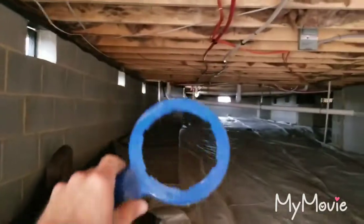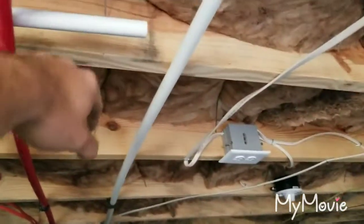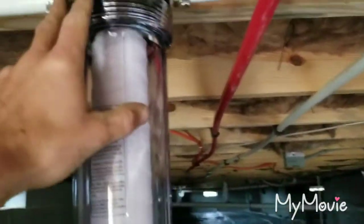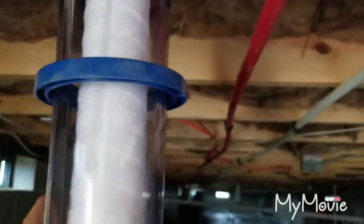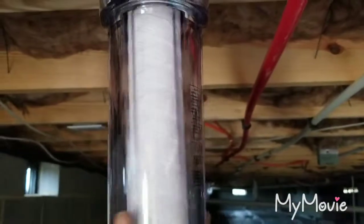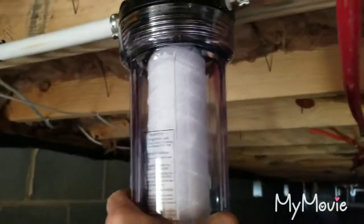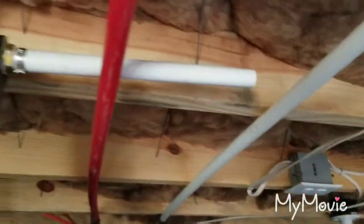If you get a filter, you'll notice it comes with a blue wrench. In order to change the filter, you have to turn this valve off and turn this valve off. There's a little red button up here — press that button to release the pressure in the canister. If you don't press the button, you can't unscrew the filter housing. This wrench is designed strictly to take off the filter housing, not put it on. Unscrew it, drop it out, take the element out, put your new element in. With both hands, tighten the housing as tight as you can strictly with your hands — do not use the blue wrench, because there's an O-ring seal and that's all you need. Once tightened, turn this valve back on, turn this valve back on, and you have changed your filter.